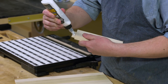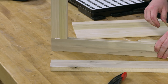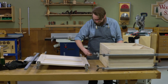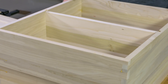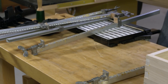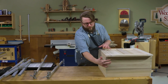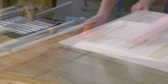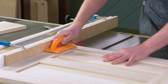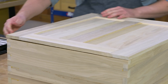The last step in our frame and panel assembly is cutting a groove for a panel — we're doing that on the table saw with a dado stack sized to the thickness of our panel, about a quarter of an inch and just a hair deeper. One key feature is that I've purposely made the tenon and the mortise deeper than the groove we cut for the panel, so when you assemble it you don't have any gap — it's a nice solid joint and the panel just sits in the groove. I'll go ahead and get this door glued up. After the glue-up, we're going to rabbet the outside edge of our back panel — about a three-quarter inch wide rabbet on all four sides — so it's inset into the case just a little bit, which gives it a ton of rigidity.